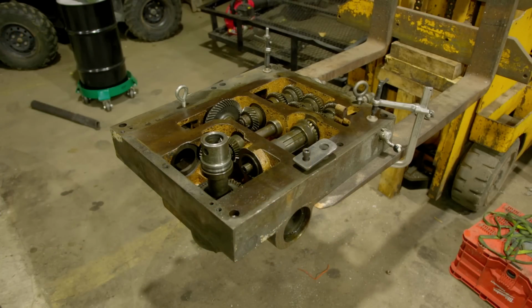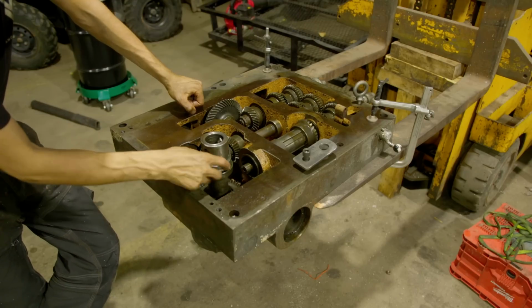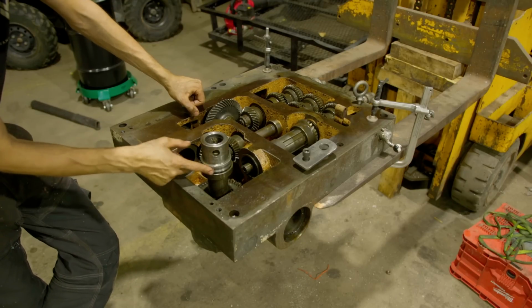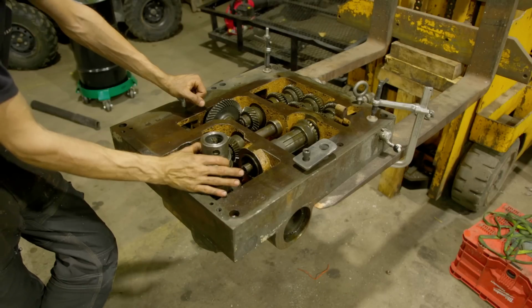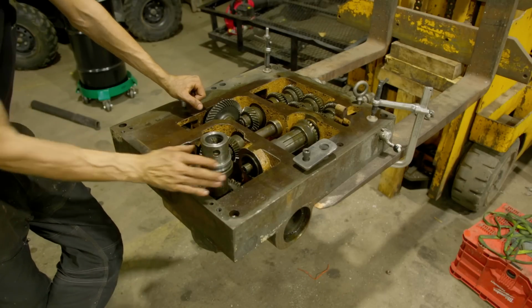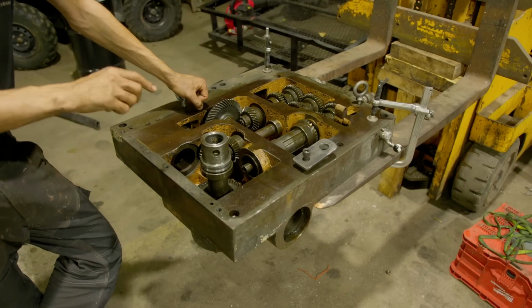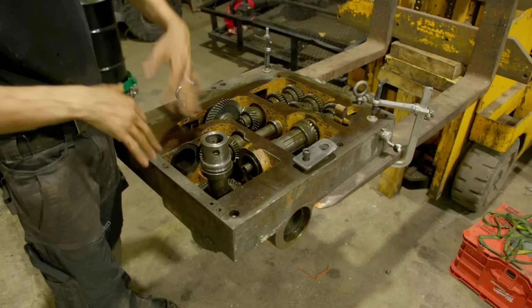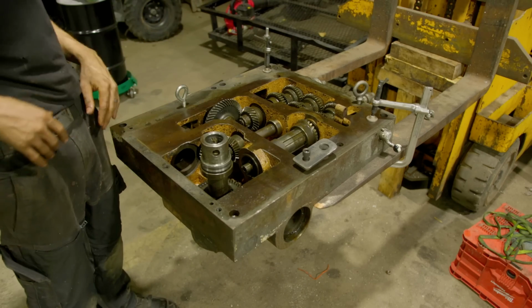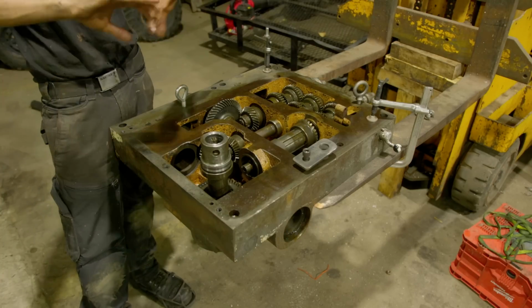All right, moving on to this gearbox. I know we touched on this briefly, but this area here is pretty worn out. I measured the top where it's not worn, and that is a nominal dimension. I don't remember. I think it was like 2 3/4. And this area here is undercut like 40 thousandths. And because of that, I want to go ahead and address that so that way we're not leaking fluid and chips and any debris into this gearbox. And that's what kind of started this whole thing.